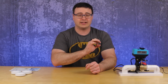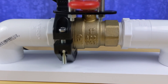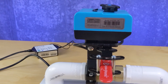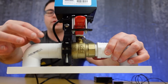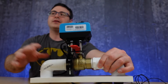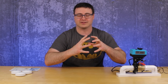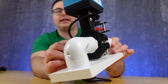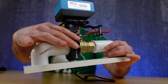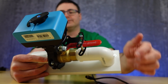There are a number of components that I really like about the engineering here. I spoke about the mounting hardware and how it could be customized to your situation. But one of the things that Econet Controls does not customize is where this is mounted on the valve — and it's really important. One of the biggest mistakes you can make is mounting the actuator on the pipe or the connection point, which can put a lot of undue stress on that joint or the pipe itself and actually crumple parts of the pipe. That's why the Bulldog has been mounted directly on the valve body — there's no stress, no chance for additional leaks.